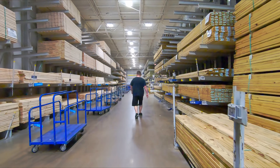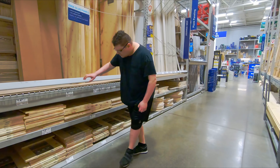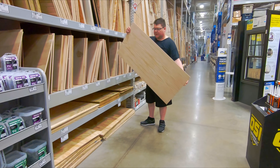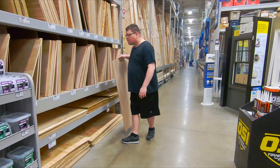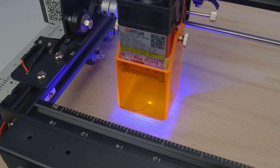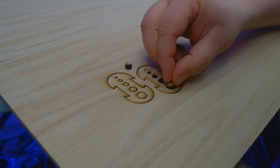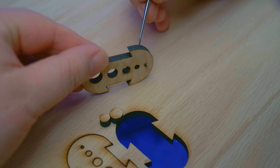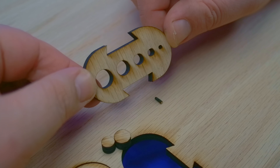In fact, this is where I see the potential for the machine to earn its keep, as I'm not particularly interested in decorating flat surfaces with burn marks when I could be making parts for things that come together to make bigger things. I just need to find some material to experiment with, and this sheet of quarter-inch plywood looks about right. For woodworking, you might do well to consider a CO2 rather than a solid-state laser. This one, however, can focus a beam onto a spot one-fourth the size of your typical diode-driven unit, which, at 5.5 watts, should cut through a quarter inch of wood without much ado. It's just a matter of dialing in the optimal combination of speed and power. For the cleanest burn, I found that around 8 passes at 250mm per minute with the laser wide open is pretty much where it's at for the plywood, and as you can see, the machine doesn't skimp on the detail. The smallest circle you see here is only 2mm in diameter, so try doing that with a router.